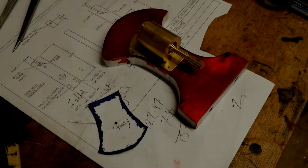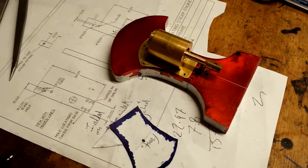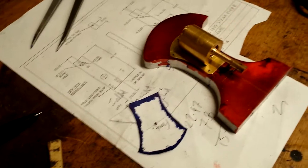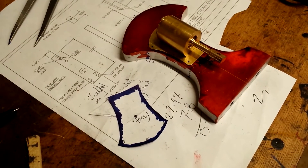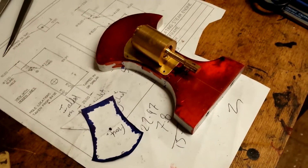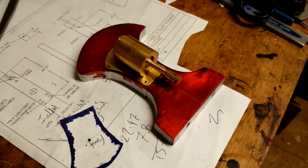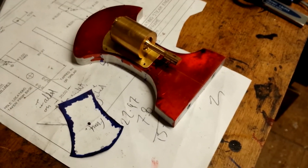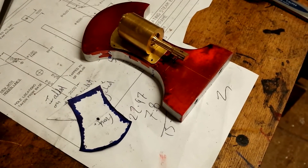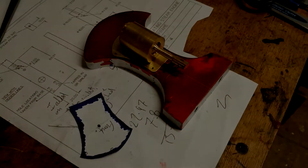Here's the brass wear plate with the cylinder on top of it in position, marked out for drilling small holes to take tiny screws to attach it to the standard. It will also be glued with epoxy — I'll glue it with epoxy first and then sandwich it in the vise between two pieces of wood for a good long period of time. Then I'll give it a fine sanding and make it smooth on the surface plate. Hopefully that will suffice to make a steam-tight seal between it and the cylinder.